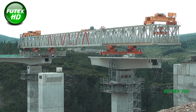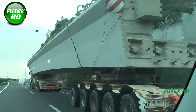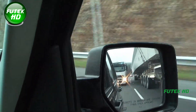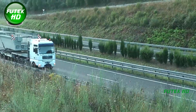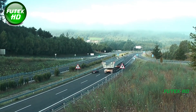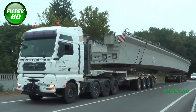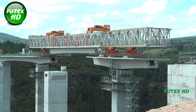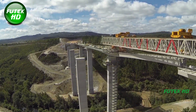In the case of the Ferreira River viaduct, the launcher placed the pre-assembled beams onto the piers one span at a time. This method ensured the structural integrity of the beams and allowed for controlled and safe assembly. The launcher helped overcome the logistical challenges posed by the river and the 60-meter height, reducing the need for auxiliary structures like temporary towers or cranes. The viaduct is a critical infrastructure project enhancing road connectivity in the region of Lugo, improving transportation efficiency, reducing travel times, and providing a safer route. Its design reflects a combination of technical precision and environmental awareness, incorporating advanced construction techniques to minimize its impact on the surrounding landscape and the river below.